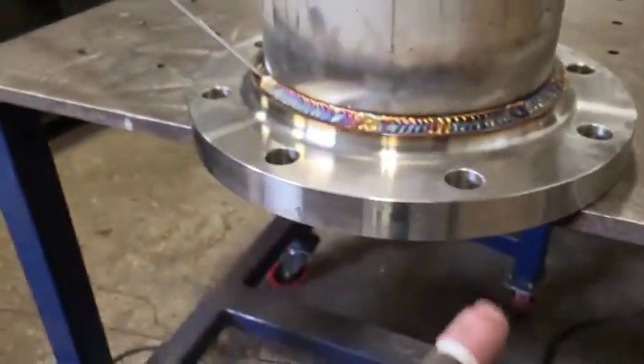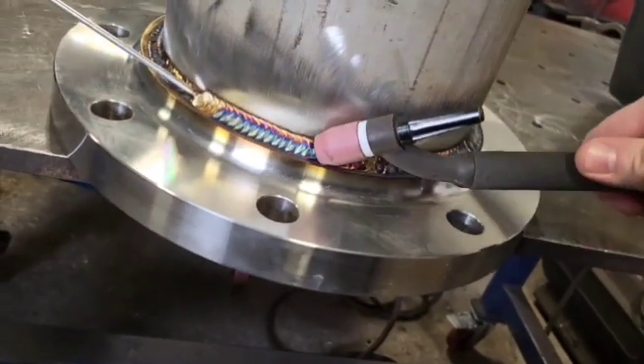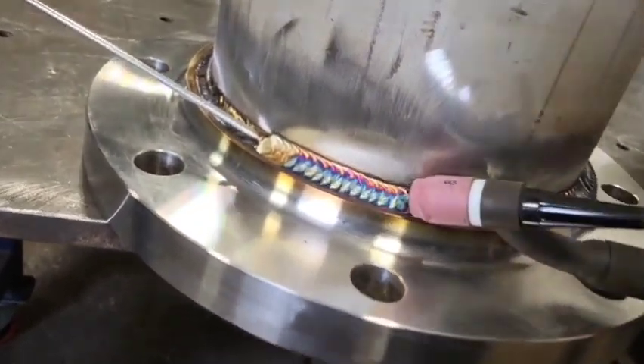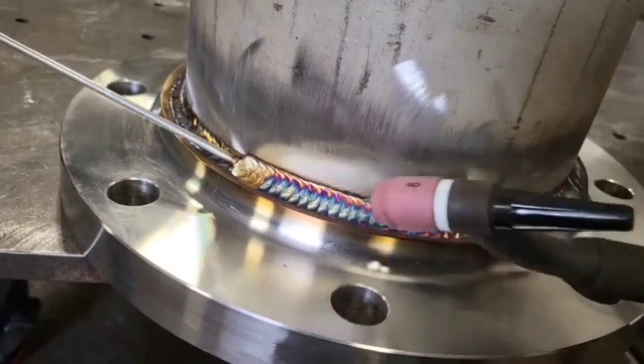Here's a trick that will help you a lot in TIG welding — walk in the cup. Hold the torch back here to get more control from it. But get that temperature turned up where you can move faster and make more consistent welds.